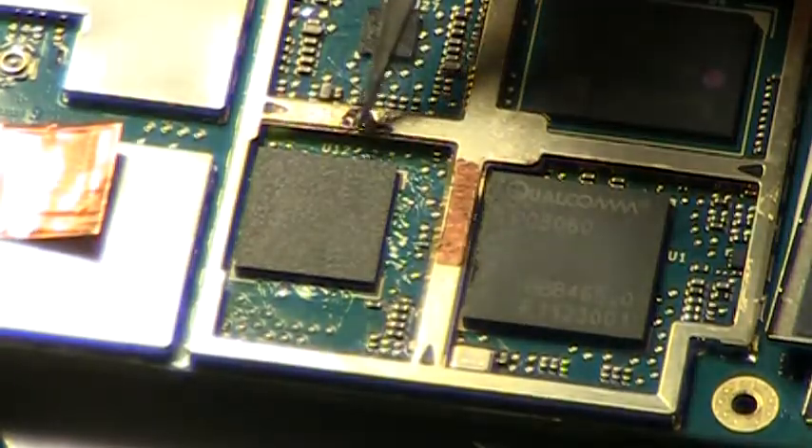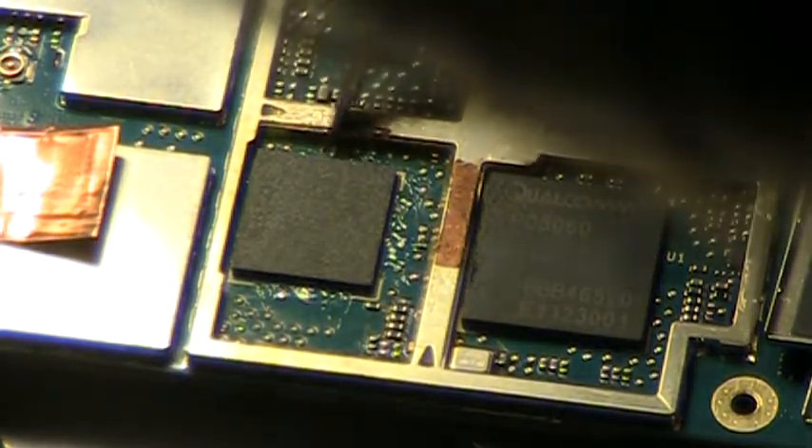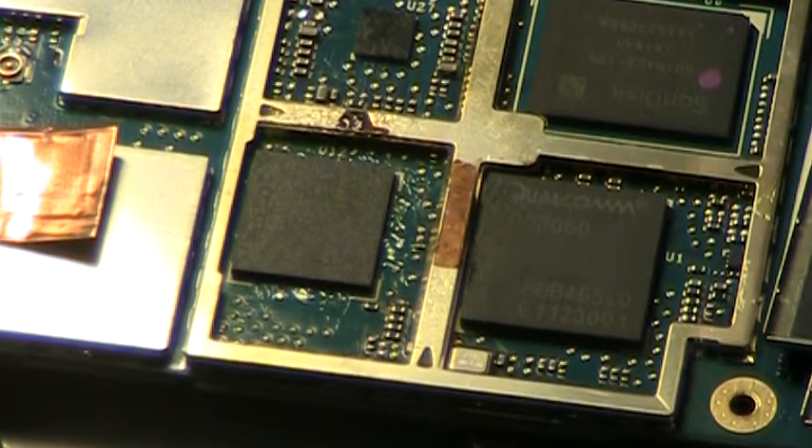That's actually pretty good. I'm going to push it over a little bit towards the camera. It really is good. It doesn't have to be perfect, but it has to be as good as you can get it. The nice thing is, once the solder melts, it kind of pulls the chip into the right place — as the solder balls on the bottom of the chip melt, they try to reach out to the metal pads underneath, and it kind of aligns the whole chip.